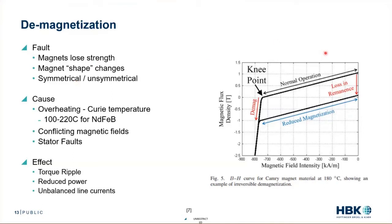To understand demagnetization I need to go a bit into the magnet rabbit hole. If we look at a magnet, the horizontal axis is magnetic field intensity — essentially the current coming from the stator — versus the strength of the magnet. With a permanent magnet, applying negative current into the air gap at that magnet makes it look weaker. At a normal operation point, applying negative 500 amps decreases strength from 1 per unit to 0.5 per unit, but it recovers when that current is removed.